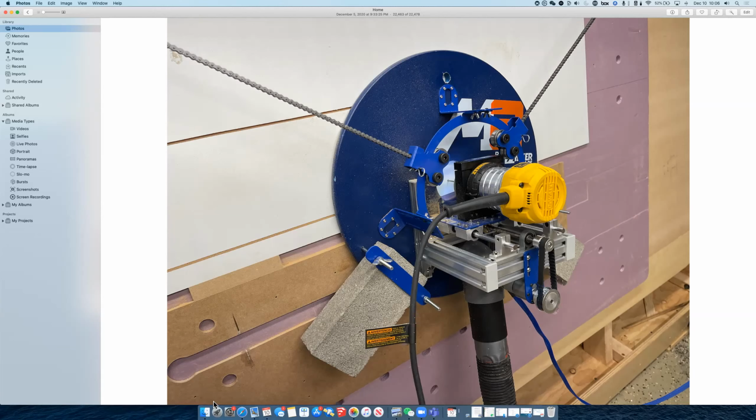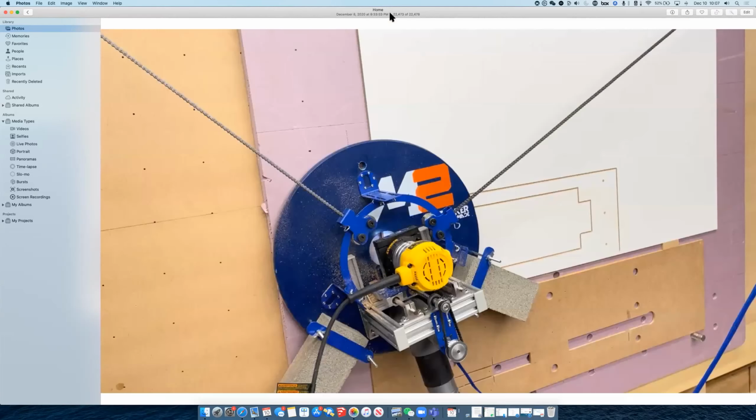So that's where we've kind of stuck with wood. That, and it's a lot easier to manipulate and have the end user turn it into what they want it to be. So like in this picture right here, where your sled is now protruding to the left of the melamine, if you were to have a similar surface like you have beneath it there to the left of the melamine, that would counteract that bit walk that you would see where the sled is stepping off of the melamine. Yeah, that's the challenge.